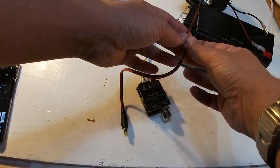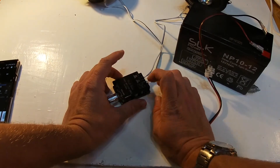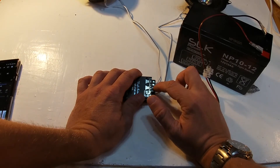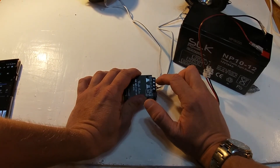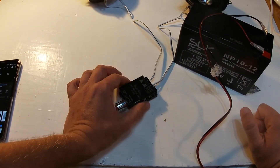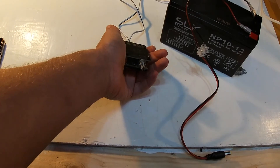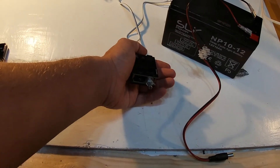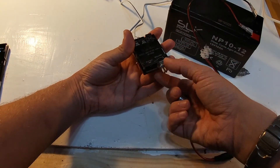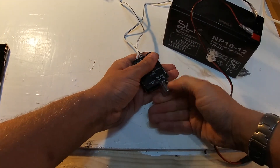You do get a DC jack input. I temporarily connected it into some screw block just for testing — I wouldn't recommend leaving it like that. You don't get any speaker wire with it, just the screwdriver to build the case. You'll need a mini flathead screwdriver to do the speaker connections — tighten and loosen them up. You can also pop the volume control knob off if you're mounting this into an enclosure and want the control out on display, then push it back on when you want to adjust.